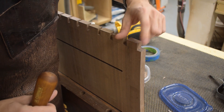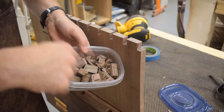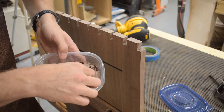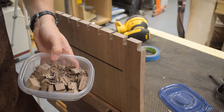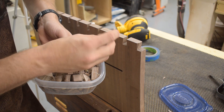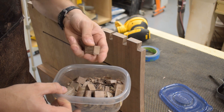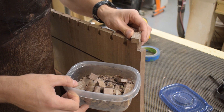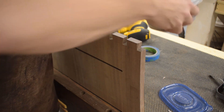I'll cut with my chisel at roughly the same angle as that grain. When I cut all these dovetails I swept up the off cuts from the floor and saved them — I'll be able to use some of the thinner pieces for a couple gaps, and also the larger off cuts from cutting the dovetails out work perfectly. I'm looking for pieces where the end grain shows a color and grain match going the same way, so I can cut a corner off and glue it on.